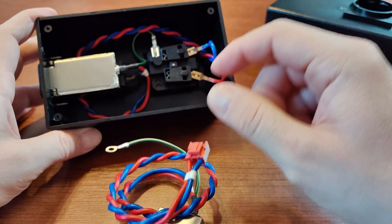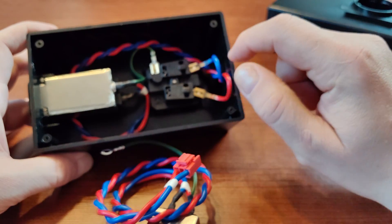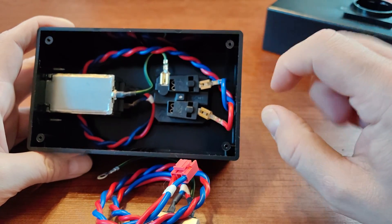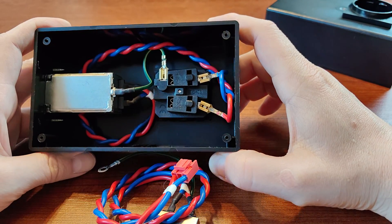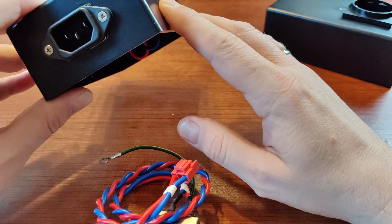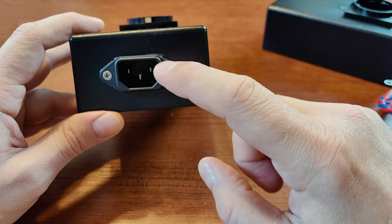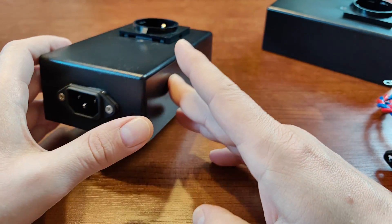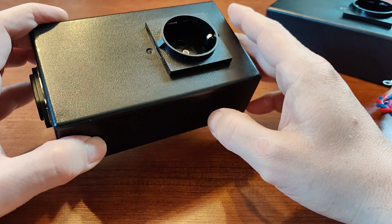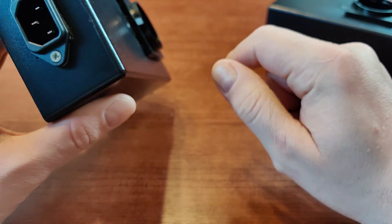After you cut the original plug, you need to either screw the connectors with bell wire if you have that kind of plug, or mount small plugs on your cable to connect them here. For the insides it's about a 15-minute job at most. The most time will be consumed by cutting the holes nicely — you can use a Dremel tool, or use your soldering iron to cut the rectangular shape with heat, then use a knife to polish the edges. And that's basically it.